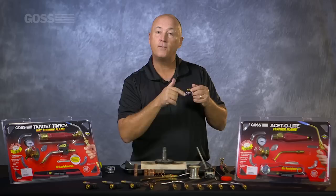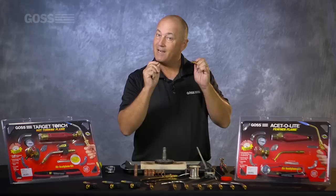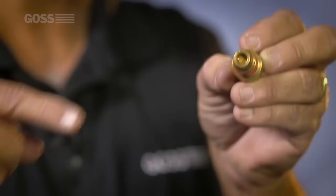With competitor tips, you have to go inside, unscrew the orifice, blow it out, and screw it back in — and hopefully that contractor screws the orifice back in properly. They have O-rings. Those O-rings can get brittle, they can deteriorate, they can pinch, and the next thing they know, they don't have the right flame on that particular tip.